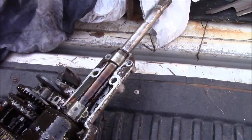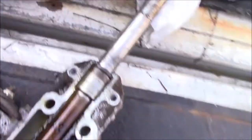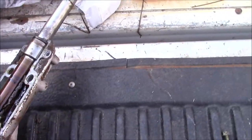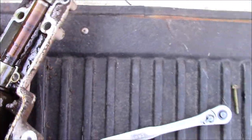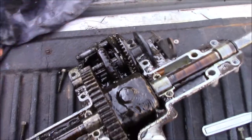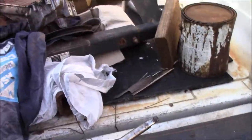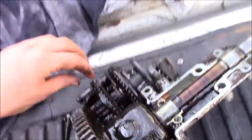Whenever I turn the pinion, look how much extra play that has right there. It won't even go, but look how much it keeps spinning - it shouldn't be doing that, especially not with one gear locked. I can't actually spin it backwards and I'm not sure why, because it's in neutral; it should be able to go either way. The play in this gear is what messed up, and that's why it would go down the hill flying and wouldn't hold back like it was supposed to.